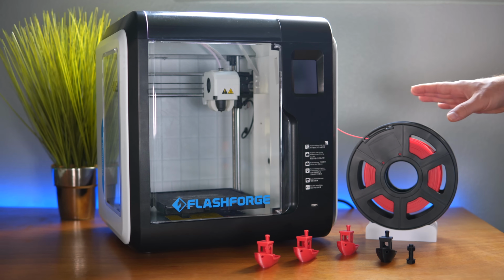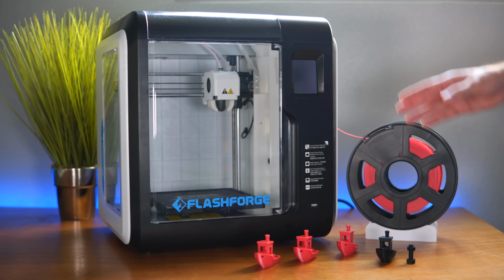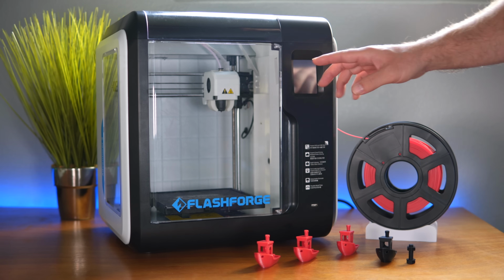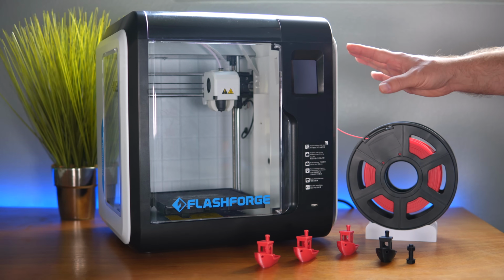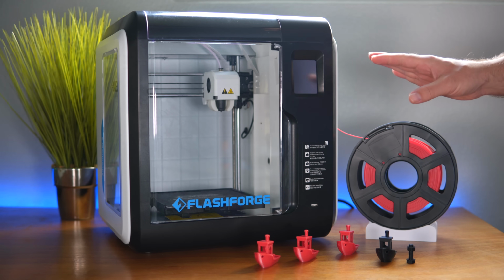The only major thing that most people might want to do is have this external little spool holder here so they can use any spool filament they want. And also, I think that fan duct is definitely a good upgrade. And don't forget to check your Bowden tube back here, because you saw how mine was moving, and whenever I put the little clip in there, everything changed.